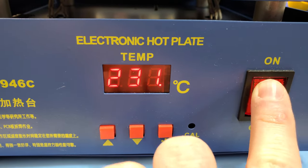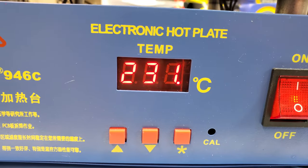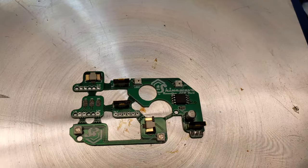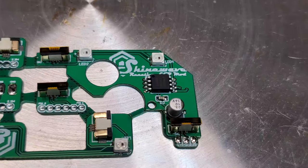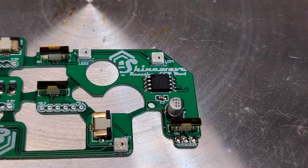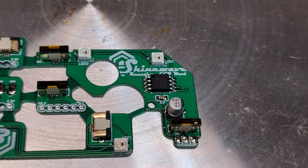Now that I've got the board fully populated, I'm going to load it up onto my hot plate. This is not really the way you're supposed to do this — typically you'd want to use a reflow oven — but this is what I've got. What's particularly cool is that as a human I'm not going to place everything extremely accurately, but the surface tension created by the solder ultimately ends up lining up the components perfectly onto the pads. If you look really closely, you can see them all aligning, and it's pretty cool.